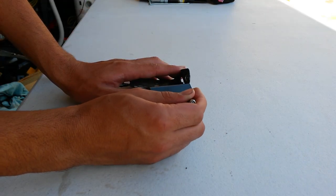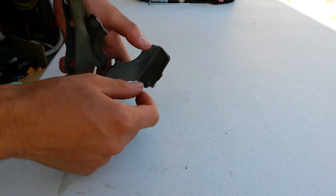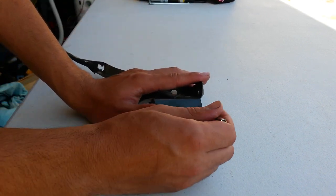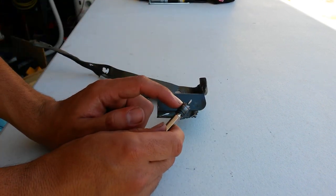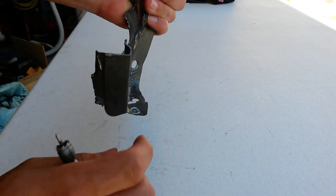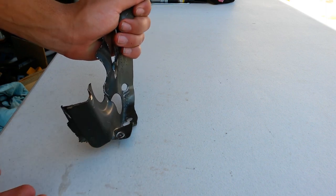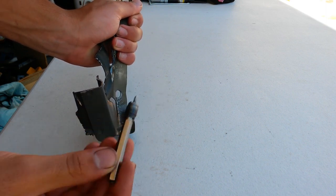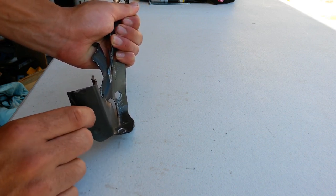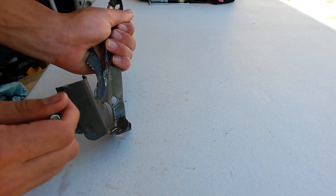And so because of that, you basically have this welded section that's still attached, but then the rest of your panel is separated, and so you can remove all the pieces that essentially hold your car together just by cutting out these spot welds. Now, when you're using this, you don't want to go too far down, though, because let's say if there is a piece that was on top of here, and you go too far down, then you end up cutting into the base metal that you're actually keeping, so you don't want to do that. So when you're using the spot weld cutter, you basically just want to go through the top section that you want to be removed, but you don't want to scratch up this base metal.